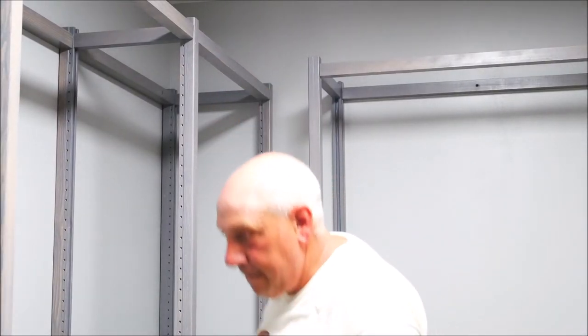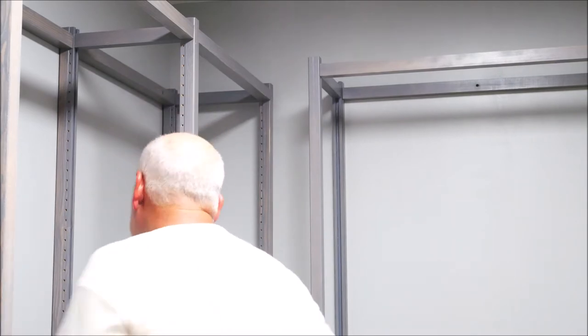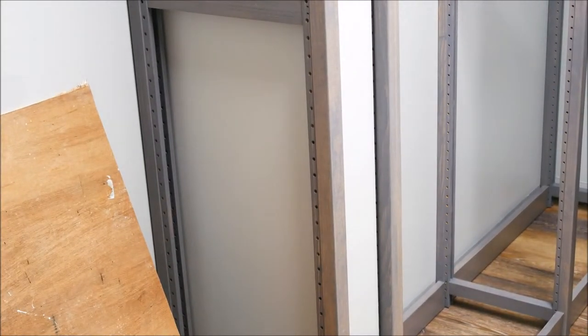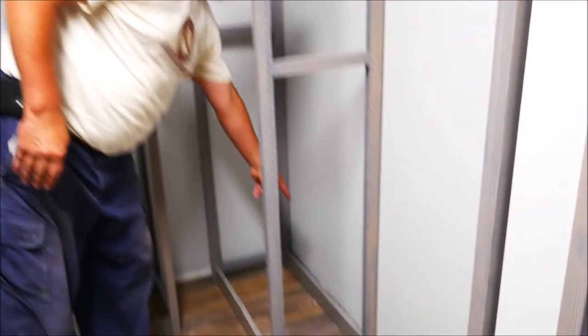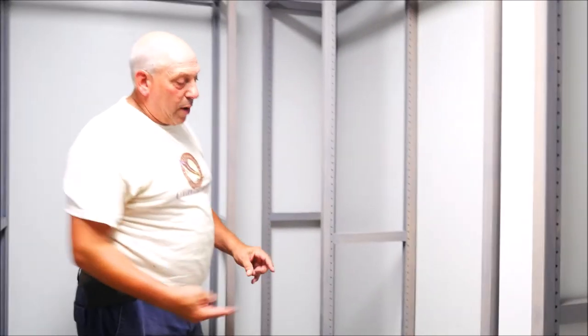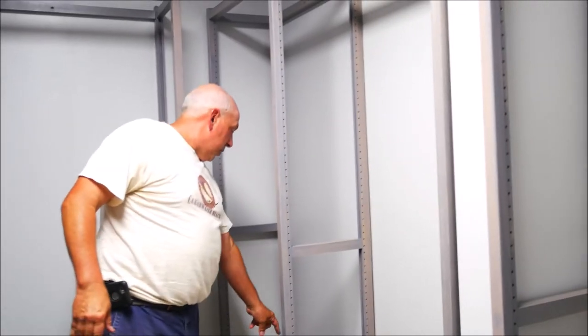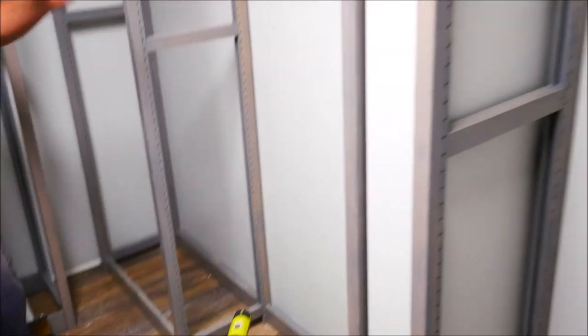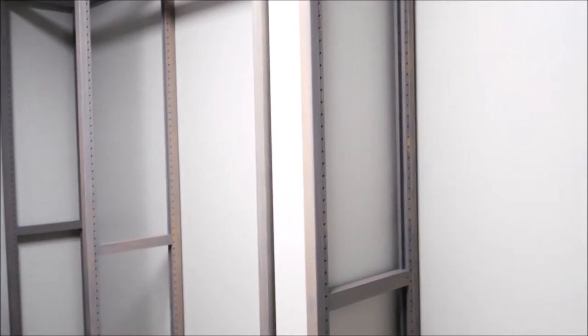For those of you that don't know everything about DIY, there are always little things you need to know in between. Mike is fastening things to the wall, but it's actually not directly to the wall. You can see there's a piece of wood right there. The walls are not perfect — and if we screw right through that gap and pull it to the wall, that will pull the structure out of square. So we're shimming some wood behind there to keep everything lined up, checking for plumb both ways — plumb against the wall this way and this way — and then fastening it.